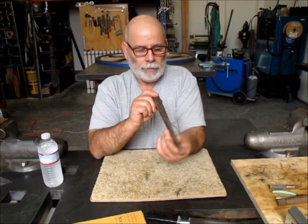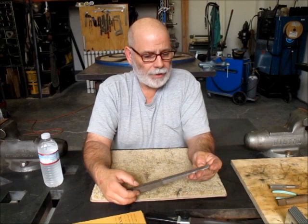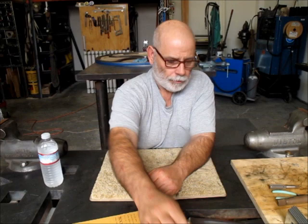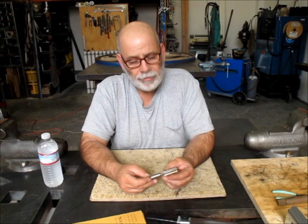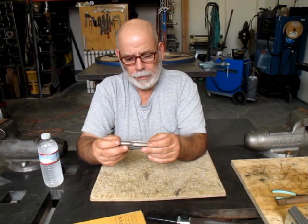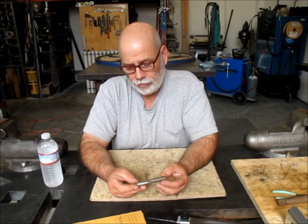Next find is a pipe separating wedge with a long taper. It's seen a little bit of use but is generally in good shape. Dollar for that — it's a forged steel wedge, tip's okay. I'm always collecting wedges and that kind of stuff. Also found a kind of oddball tap — it caught my eye because of the real fine thread. It's a 5/8"-24 threads per inch, which is kind of an odd thread. Every once in a while you need to chase a fine thread — dollar for that too. How can I pass that stuff up for a dollar?